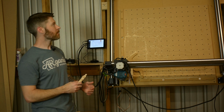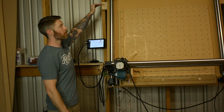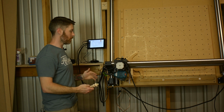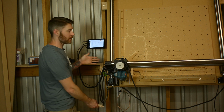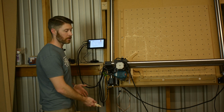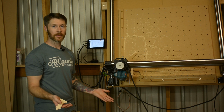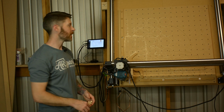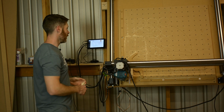That being said, what I would really recommend and what I'll end up doing is actually bring this brace down to about waist level somewhere and build foldable legs, so that when I'm not using the machine, I can tuck it away and it's not taking up a lot of square footage. But then when I want to use it, I just simply take the hinges and pull it out at a full 90 degrees, fold my legs out, and I have my CNC table. Kind of what you would do in a folding work table type scenario. And if you did something like that, again, you could just mount the controller to the underside of the platform.